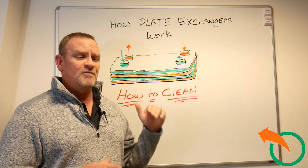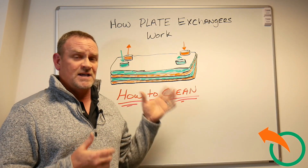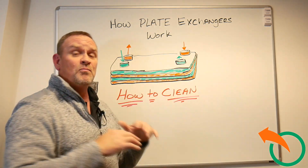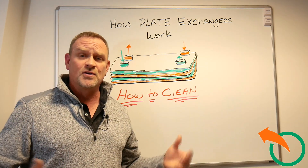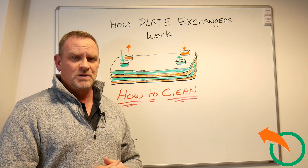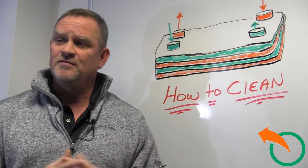Here's another little trick. For people who have very bad water — including myself, I have a lot of minerals in my water — instead of buying a 10-plate exchanger, definitely upgrade to a 20, because you have more surface area and more area for that buildup to happen, which gives you a longer life. You could even go to a larger plate like a 30 or 40. My 20-plate has been up and running in my hard water environment for about 10 years, and I'm still running effectively.